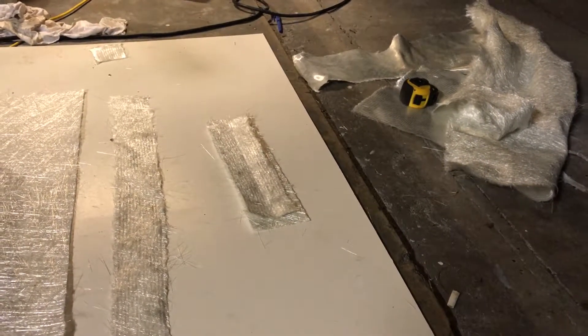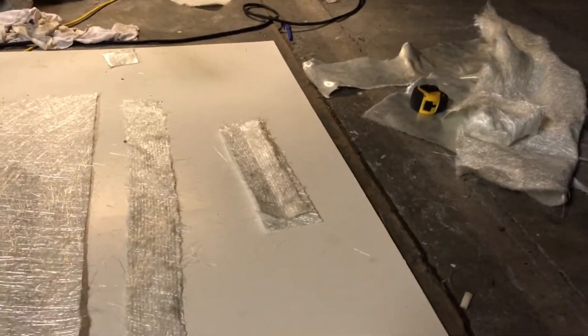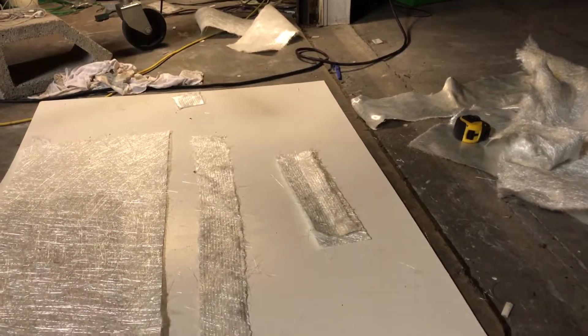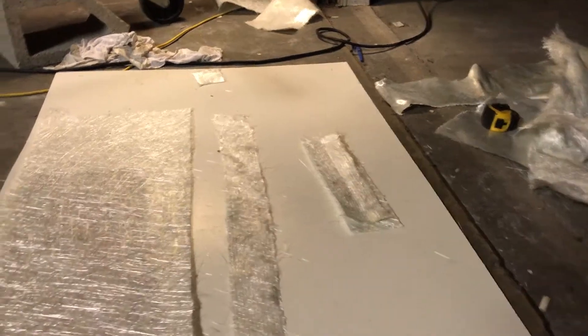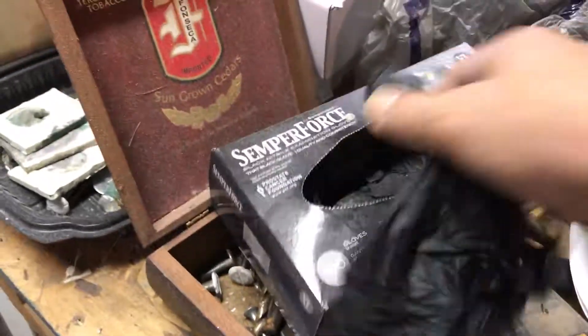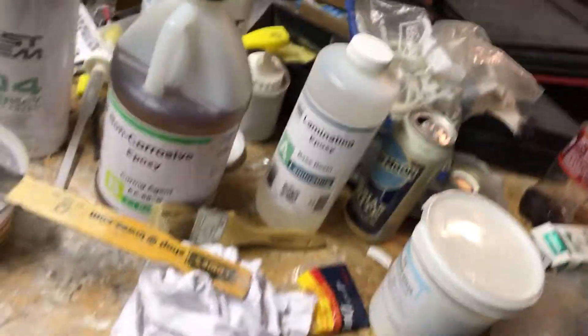I made a little piece for the front — hopefully I can get it to wrap around the bow without too much of a fight. I'm going to really soak that one up so it's more flexible, because the more flexible you get it the easier it is. I've also noticed that after you've stuck it on and wait maybe five minutes, it absorbs a little more and lets you flex it around. You want to put some gloves on — buy a box of gloves, because you're definitely going to get epoxy on you and at least gloves prevent more of it, because it's a pain to get off.